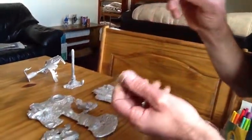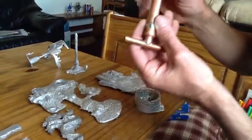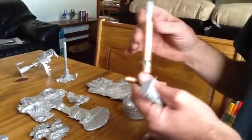And this is what we're going for — this is the steam engine piston. Here's one that I machined. I just chucked it in a drill and then ran it against the file until it fits smoothly into the cylinder. So we'll machine this one and then I'll have to make a smaller one for the valve.